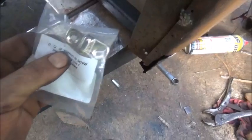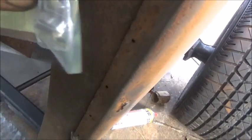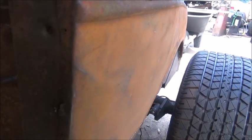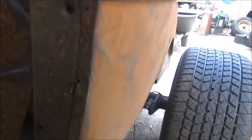Now the screw holes for the other two pieces, I'll show you what I've got. Okay, here is the dovetail. This piece mounts right here, and it fits into a groove inside the door and helps line the door up. I don't know what size threads these are, but they go all the way through this wood, and then they have nuts on the back side. There's some screws that would have gone through here that are not in it. We'll put some back in that just run into the wood, and we'll probably drill them and run them all the way through that plate also and tighten them down, because we're going to leave that wood inside of here to keep the structural. If not, we're going to have to weld a piece in.